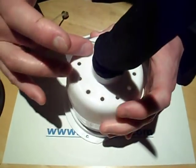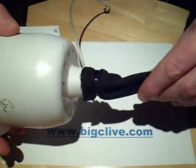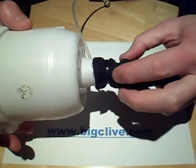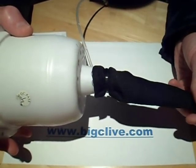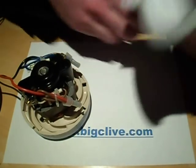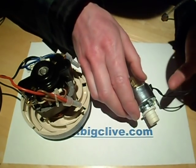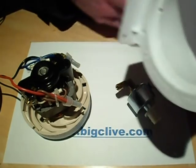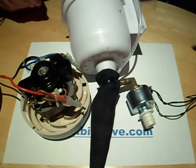All these holes around the outside are also blowing air out. It's all sort of balanced a wee bit. And when the foam has grown out to a certain level, the outer airstream catches the foam and blows it out as tiny little pellets of foam. So really, a vacuum cleaner motor, a little solenoid pump — although some of them use a Venturi effect, just carrying the liquid up without a pump — and the sock. And that is how a snow machine works.